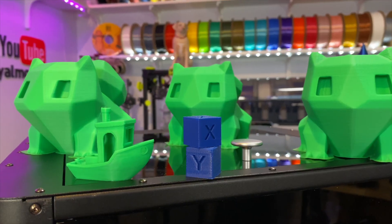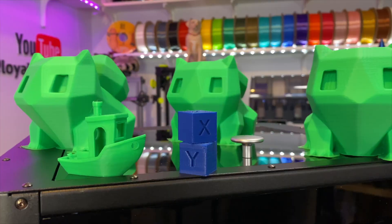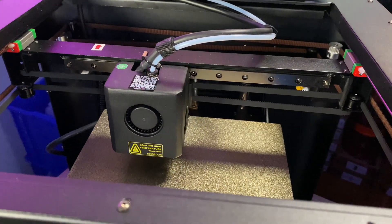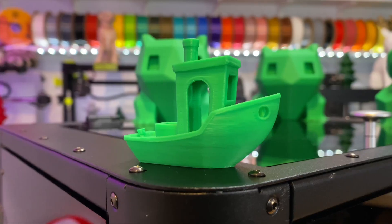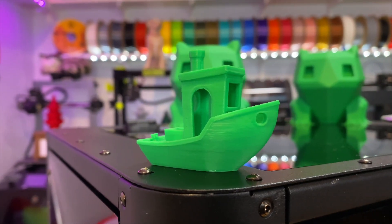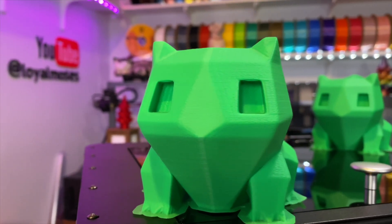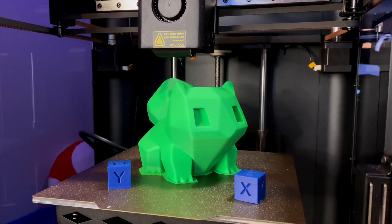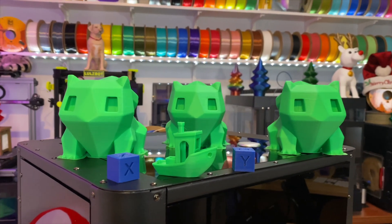As far as print results, my initial results were kind of mixed — not super fantastic, which perhaps isn't unexpected for a $379 machine. But the hardware is built so strong and so well. The third time I ran the input shaping calibration, I got the best results; that can also come from the machine loosening up a bit after shipping with tight belts. I did start to get some better results. There is still some ringing, but I could probably spend more time tuning to remove that completely — which is exactly why I'm calling this the perfect machine for people who want to tinker and play.